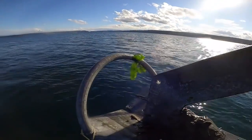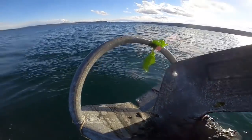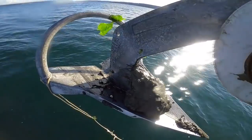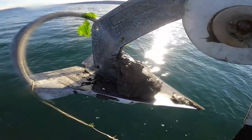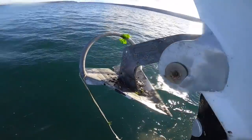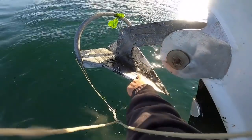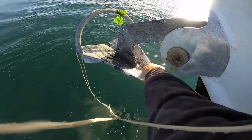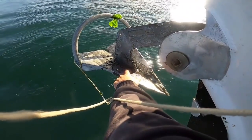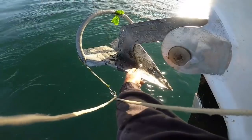Okay, no mud where the holes are, no mud back where those fluke palms or whatever we want to call these turned up things were. Nothing there now. Good, held full power, solid as a rock. A hole or two up here might be good, but that's going to make the toe here weak. Might break off. I purposely put the holes back here to take advantage of the strength that the shank provides to the fluke.